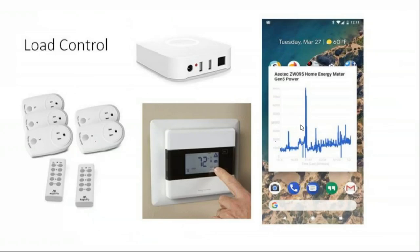Really why I like the Z-Wave or Zigbee controls is I can design these systems and pre-program them to work wirelessly out of the box without having access to the customer's Wi-Fi. So when you're designing a smart home automation system, there's tons of gadgets, tons of devices. The setup time on site becomes the critical factor. It's nicer to have everything pre-programmed out of the box. And how do you do that if all the devices are connected to the client's Wi-Fi? At the very least, you need to know their Wi-Fi password. But instead, you can deliver your own wireless communication system right out of the box.